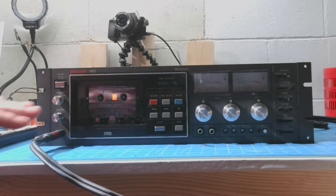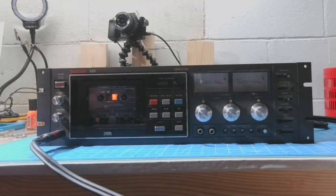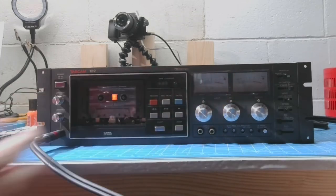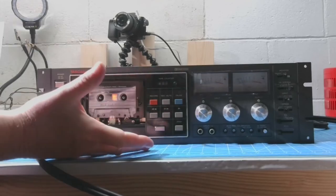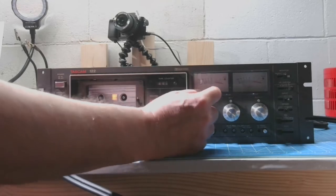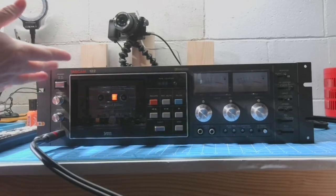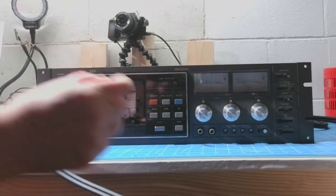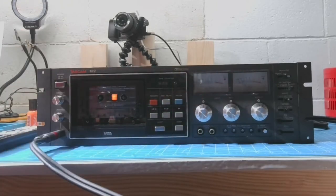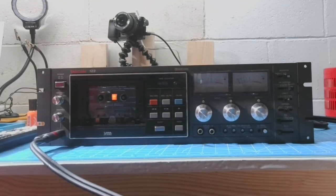You can see that the needles are moving but there are no lights in the meter, so that's a problem that's got to get fixed. I'll wait and do that when I'm done with everything else because I'll have to take the face off — the light bulbs in here are just gone. The deck is 40 years old so it's not reasonable to expect the light bulbs to last that long, especially since it was probably left on all the time. What I will probably do is put some LEDs on the outside up underneath the meter so you can see the needles move better.